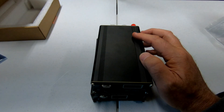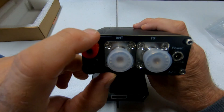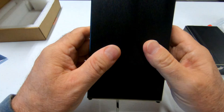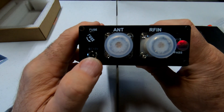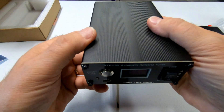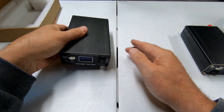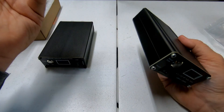Which one would I buy if I was buying one? To be honest, even as much as I like the idea of the wire terminal on the back, it's not something I would probably use because I like to get my antenna further away from the transmitter. If I had to buy one, I would buy the one with the built-in battery, because now we don't have to worry about powering it in the field. If you want to, and you have the power, you can put power to it — it says DC 12 volts and it is fused. But if I was buying this for my home shack, I would buy the powered one, because you're going to save a little money and you have power at your house anyway.